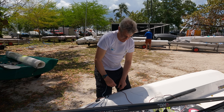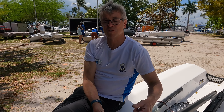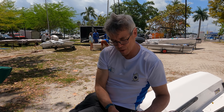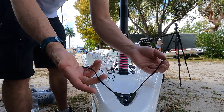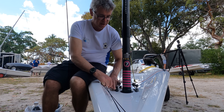You want the lines you're going to grab to adjust to be on top of the ones you don't need. The take-up system just has to work — it doesn't have to be perfect, but it does give every Aero owner the scope to put their personal touch on their boat. A lot of people have elaborate take-up systems, and while it's not really critical, it allows them to put their mark on the boat. I'd minimize the length of ropes, length of bungee, amount of fittings, and complexity — keep it light and simple. The routing normally goes right up the bows through the bow fitting, and every owner could do it differently.